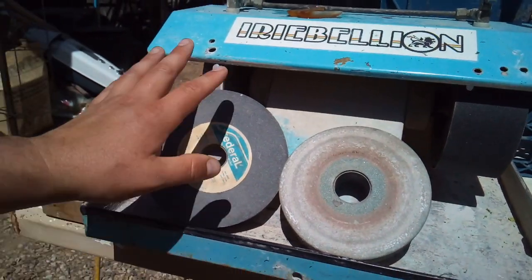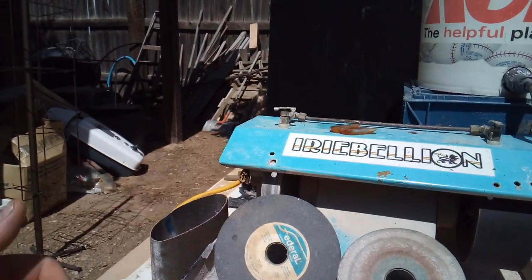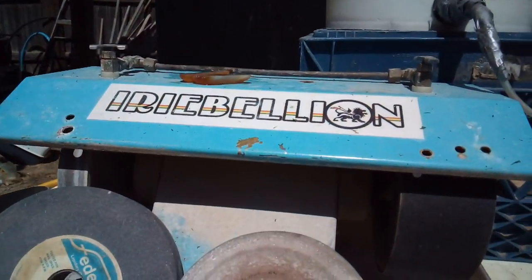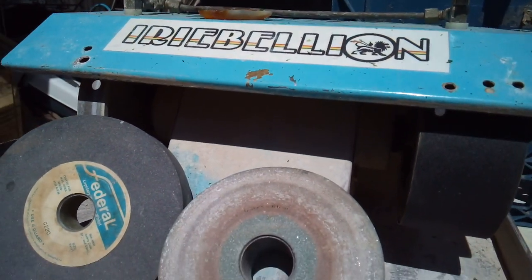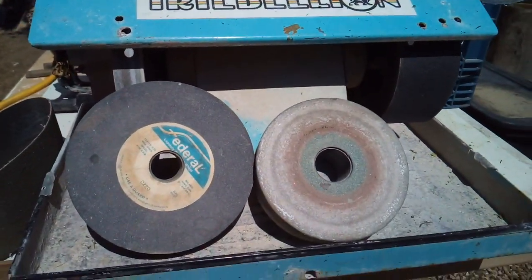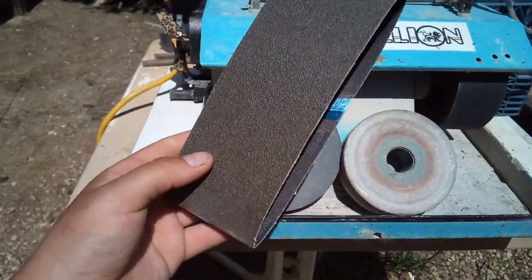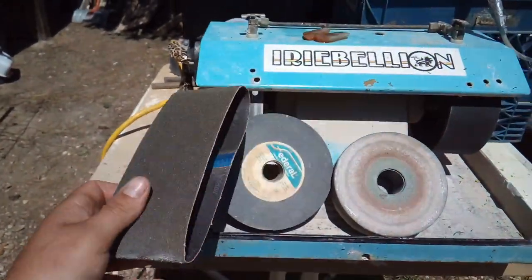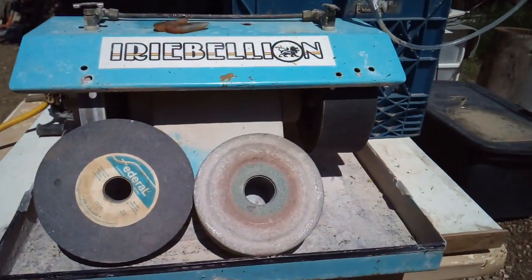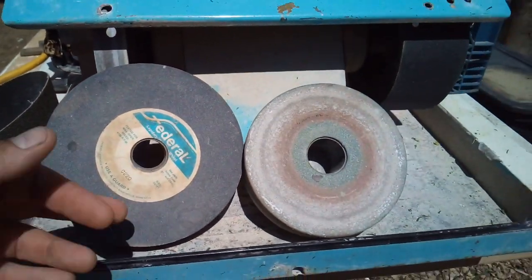Most folks know me for using almost exclusively diamond machines — I usually use my EZ Cab or an 8-inch Cab King — but I do have a big time love for silicon carbide hard and soft wheels. I would love to use an 80 grit hard wheel for you folks, then perhaps start on a 60 or 80 silicon carbide belt, move on down the line: 120, 220, 400, 600, and 1000. But I don't have any of my 80 grit hard wheels here for silicon carbide.